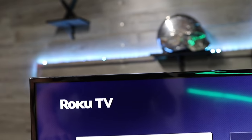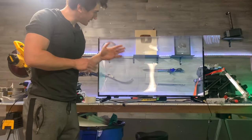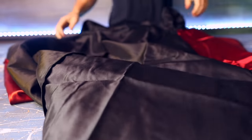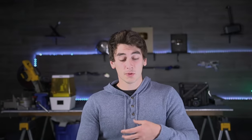Since we can't actually get rid of the bezels, we need a creative way to make it look like we did. I was playing around with these lenses, and look what happens if we bend them up around the bezels — the bezels kind of disappear. I was going to add these lenses to the TV anyway, so I'll just make them curve up on the edges to blend the TV image with the background. I covered the entire screen with these lenses, leaving a spot for the detection camera, and honestly I think it looks cooler this way — like a mysterious magical box Harry Potter might actually have. I can make it battery-powered with a battery and power inverter. For wearing it, I decided to mount it to my back, covered with a snap-off cloak. When we want to go invisible, we rip off the cloak — it breaks away revealing the screen, making us invisible. The camera is mounted to the TV with a metal bracket that wraps around the chest, keeping the camera fixed in relation to the TV so the framing doesn't get messed up.